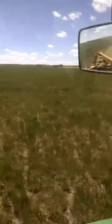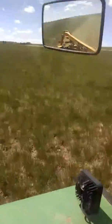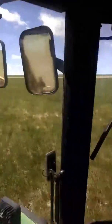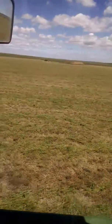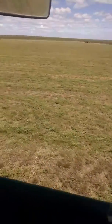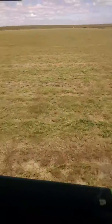These knives probably have around 120 to 150 acres on them — they need flipped over. I'll get another 120 to 150 after that. A box of knives will cost me about $100. You can see the kind of cut it's putting on the hay — what little hay there is — leaving very little on the ground.